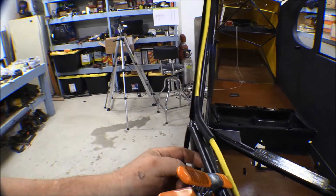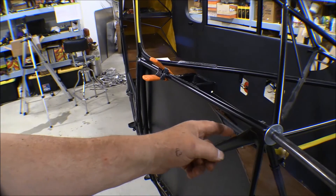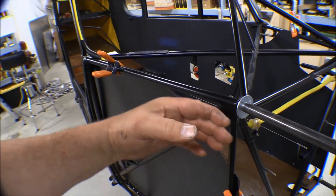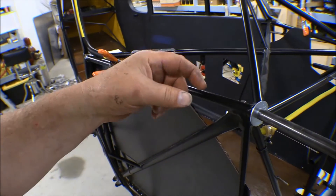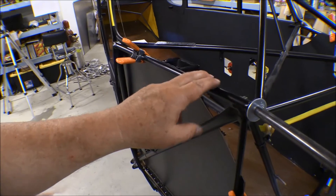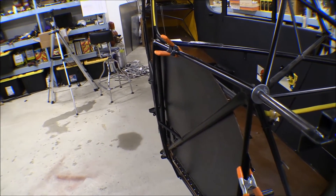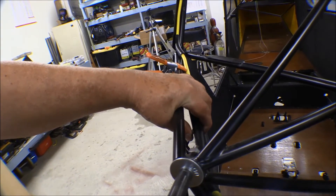I've got the right forward wing fuel line in and I'm pretty happy with it. There's a short piece of 3/8-inch fuel line where it comes up around the rib former and around the post. It comes down the window post and bends here. Normally these lines would go underneath and along the inside of the boot cowl, but on the other airframe the back-seat heater hose ran past this fuel line and got pretty hot — they had to have a shield on it — so I decided to run this one inside instead.